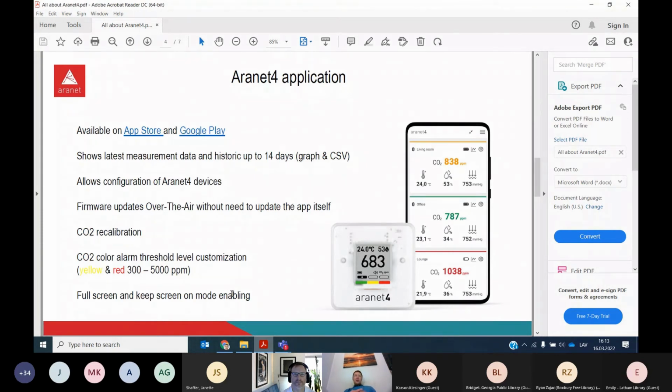So it would be necessary to take it outdoors. Our general recommendation is to do it annually. You take it outdoors and leave it for 10 to 15 minutes without the presence of living organisms, whether these are plants, animals, or humans. You need some space where there are no living organisms within about 2 meters, and then you do the recalibration in the fresh air outdoors for 10 to 15 minutes. So it calibrates to the correct baseline and regains its accuracy.